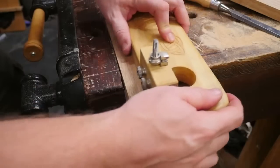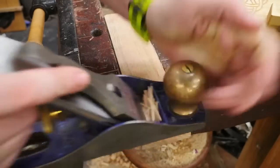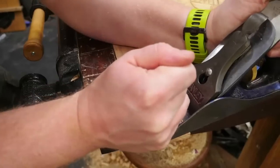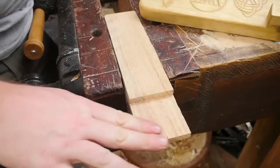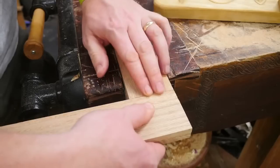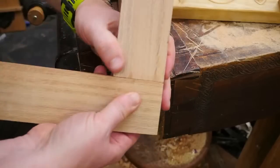And then, here, because I've just done this space at the shoulder, I could come into the plane and take off. Ooh, don't go all the way through, James. Just a couple shavings that way. Turn around. Take a couple shavings off the other side. I've taken off material all the way across. Put a little burr right there, and put that in there. Okay, that's pleasing.